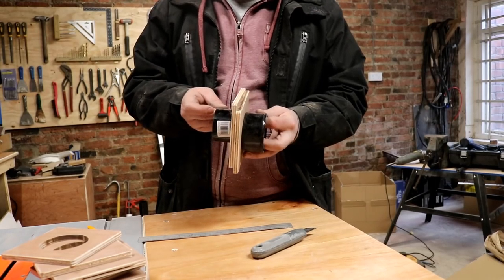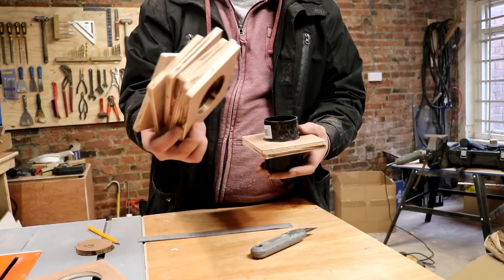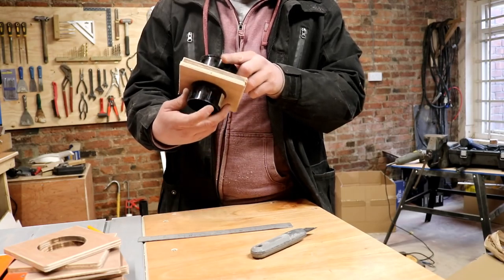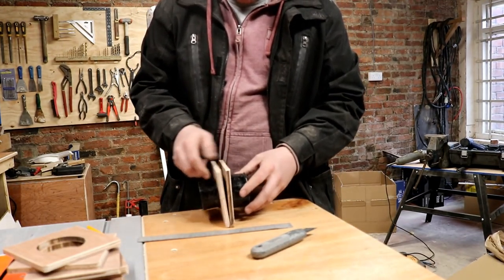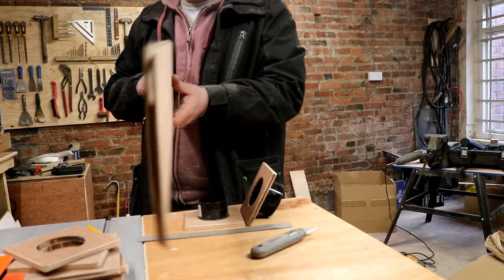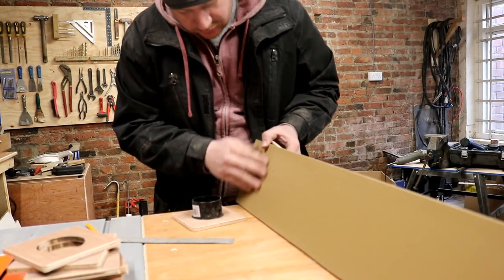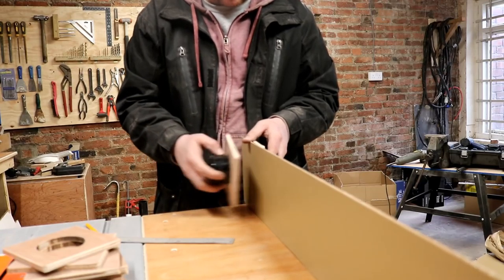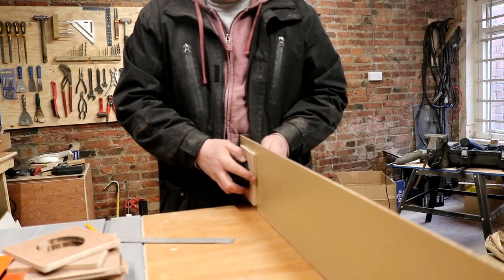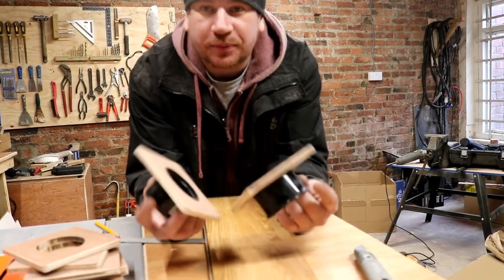The two outer sections of the blast gates are all cut. They're all stacked here. We've got 6 blast gates in total. Now all I need to do is put the separator in the centre. And what I intend to use for that, I've got loads of this MDF laminated flooring to go in between, slide back and forth. I just hope that it's going to create a good enough seal, but the idea is I can do it really quite tight and it should still slide. So we shall see if it works.